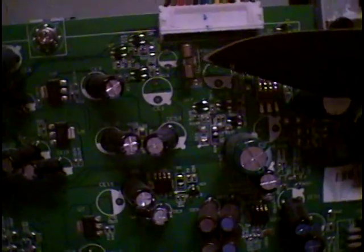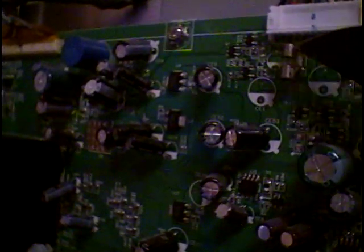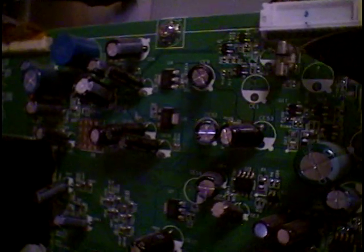There's another one just like it underneath — it also says 3 amp. I soldered a new fuse on top of the dead fuse underneath. I put some soldering flux on the contacts and then just soldered it directly on top of the old fuse.